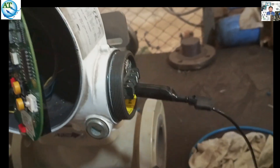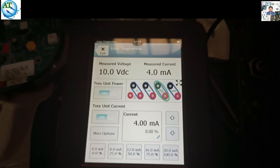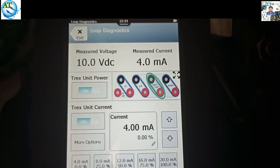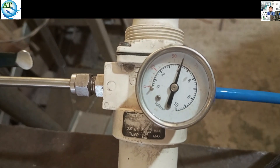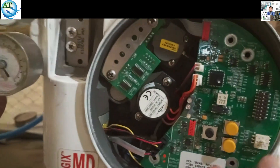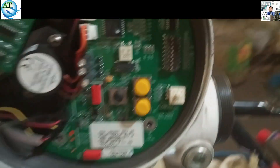Now we connect the power supply again. Then you can notice the condition. Now it is 4 milliampere — power is on. See what the condition of this valve is using the new card. At 4 milliampere, the valve is in the closed position. In the previous case with the old card, it was going to the open position automatically. But now, with the new card, at 4 mA with 4 kg per centimeter square air supply, the output is zero — that means the valve is in the closed position, as desired.